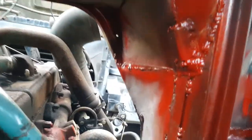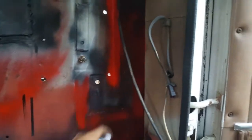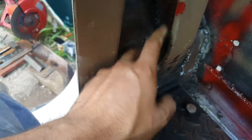There's a lot of welding here — fill in these holes — and I put some primer paint on everything just to prevent rust from ruining the work I did. I closed this all up here as well, which required a lot of work. The reason I closed this hole off is because this is where the cab started to rot in the first place — water, mud, salt would get in there under the frame and stay there. So this is all blocked off now.